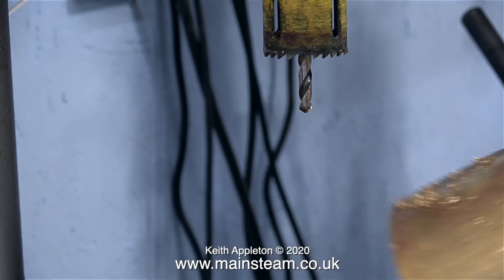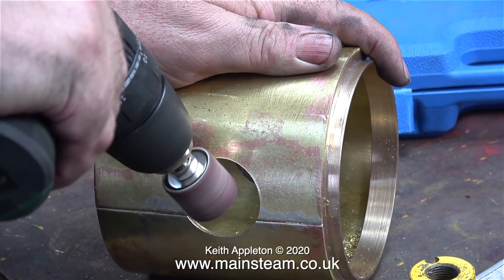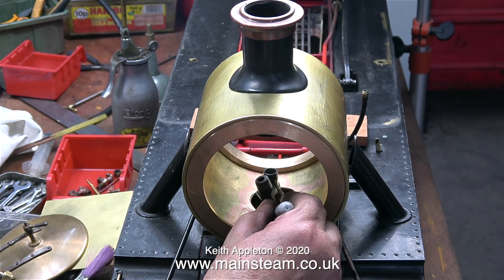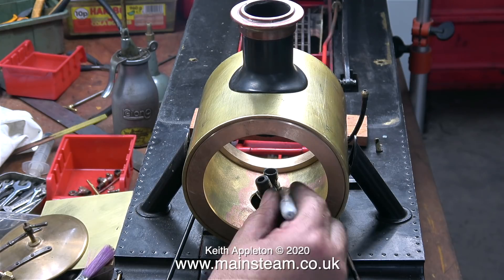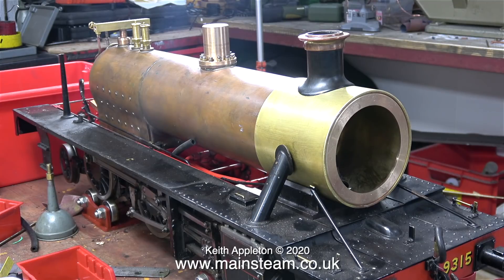That's the bottom hole cut. You can see from this clip that the seam is not in the centre — that's because I didn't follow my gut instinct and drill the hole in the top part of the smoke box where I marked it in the first place. It's not a problem though, because this is on top of the smoke box saddle so you won't be able to see it. In this clip I'm using the drum sander just to deburr the hole. When I sit the smoke box in position on the smoke box saddle everything looks okay. I may enlarge this hole slightly just so that it doesn't touch the steam inlet pipe, but when I fit the boiler loosely in position it's looking okay.